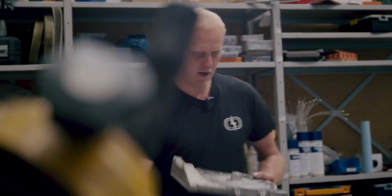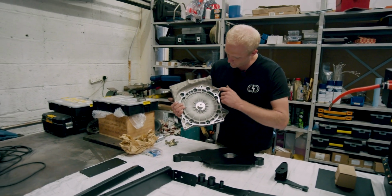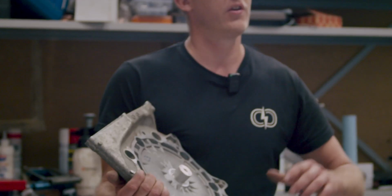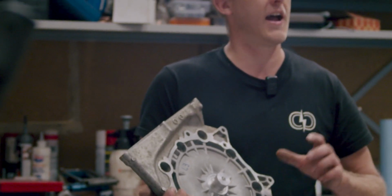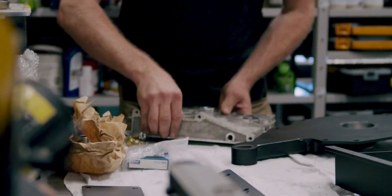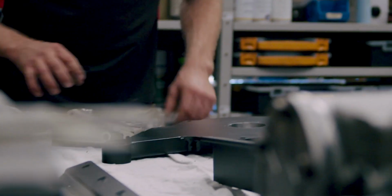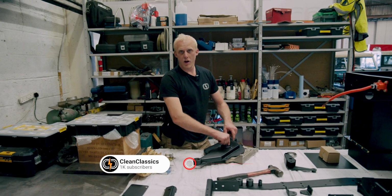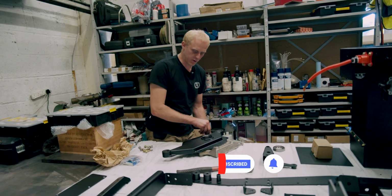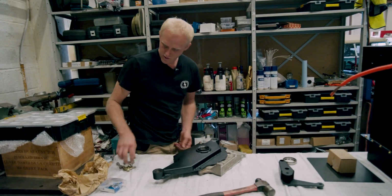I don't know if you can get a shot of it, Raf, but where the dowel holes are, we've actually machined out 2 dowels in the lathe to ensure that the hole's concentric with the center of the dowel holes. And then we've got a tolerance pin that fits in that as a center punch to ensure that those dowel holes end up in exactly the right place on here to ensure that bearing is concentric with the motor. So I've assembled our alignment boss and an old bearing, just a bearing that we've used before for mock stuff that we wouldn't then fit to a vehicle.